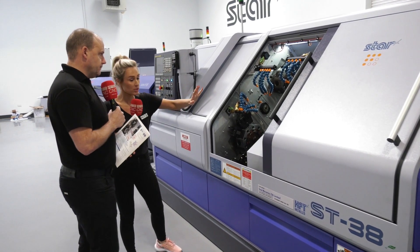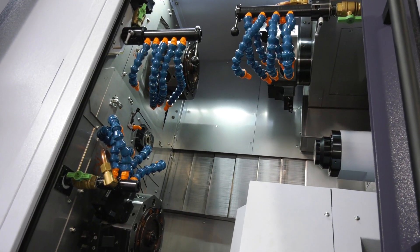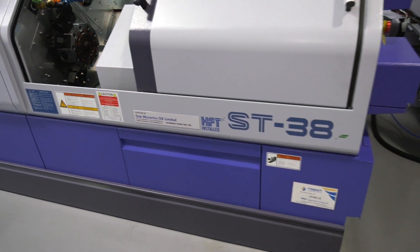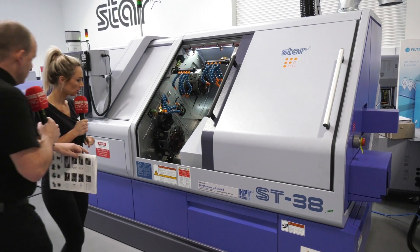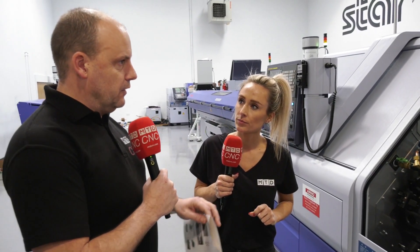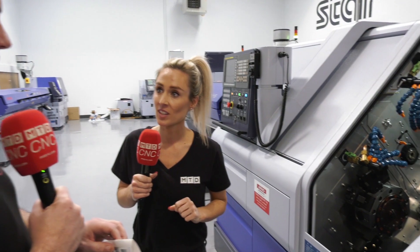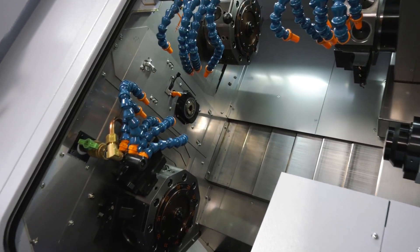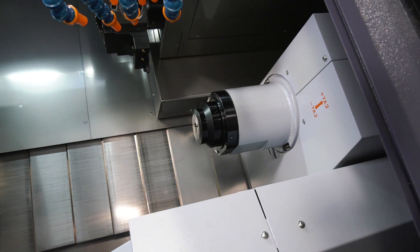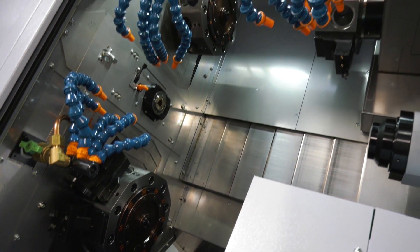One of my questions is about the size — this is a lot bigger than a lot of the other Star machines. Well, the weight of this machine is almost seven tons, and it sits in a footprint of just a couple of meters by just over a meter. You've also got a lot more power on the spindles, and a heavier casting. If you went back two decades ago you'd look at sliding head machines for small brass components at high volumes, but these days you're talking about aerospace, titaniums, medical sector — more difficult materials where you still need to get parts off quickly and accurately. For that you need heavier, well-built machines with powerful milling capability on the turret as well as turning.